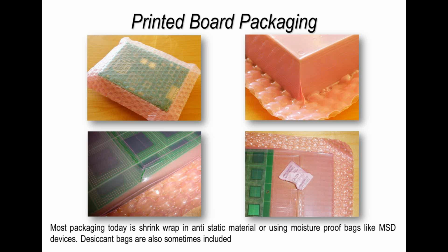But the effect of the packaging you should bear in mind. If you've got lots of boards which have got sharp edges on, those sharp edges can cause the packaging to split and crack. So on the bottom left hand corner you can see how it's opened up. Now we don't get much protection, but remember the plastic is porous anyway, so plastic will not stop moisture ingress into the board. It will protect the board, it will give it some level of protection.